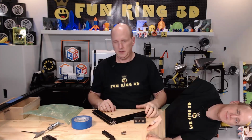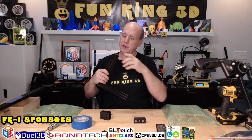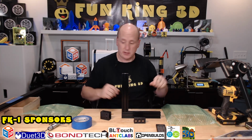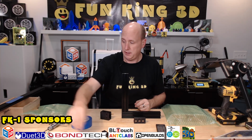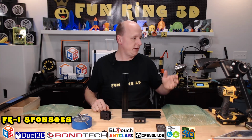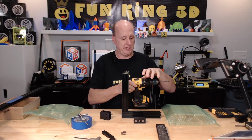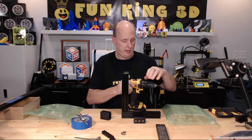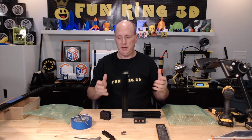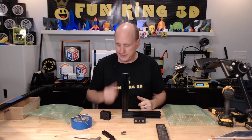Now watch this. All right, so in this part, I want to show you how I went about tapping the end of the extrusions. You can do this by hand or you can do it by power. I will admit I did most of the tapping using my drill by setting it on low speed and setting the clutch to slip. I found for my particular drill that 7 was a good spot, that it would still kick the clutch over when needed, but yet it still had enough power to tap it.